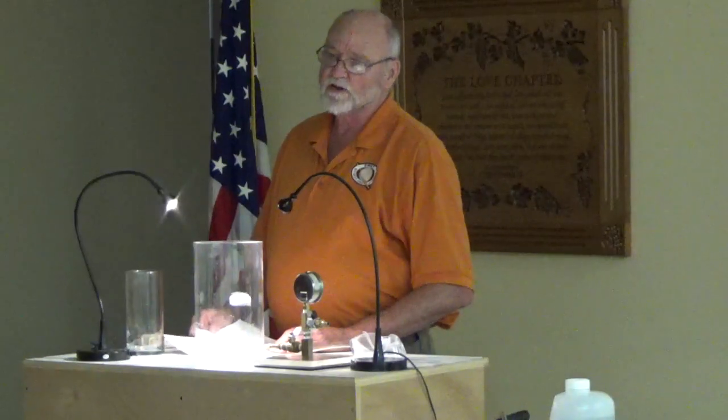Well, your oil will get cloudy too, won't it? It will. When it gets cloudy, you better change it. When it doesn't look clear like that, you need to change it. But I wouldn't wait for it to do that. I'd change it on a regular basis. If you're using your pump a lot, I'd set up your little schedule and change it.